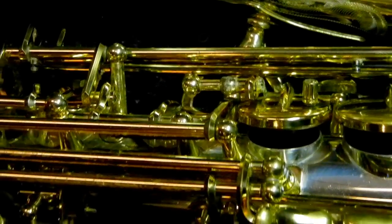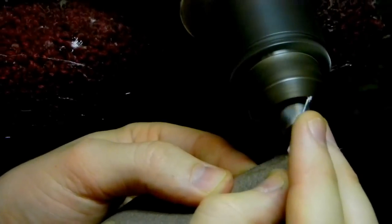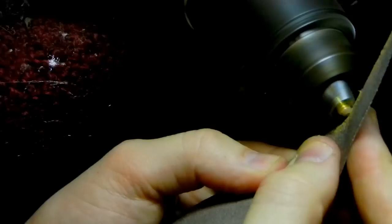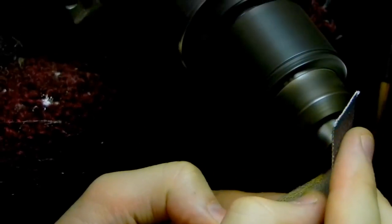Now doming your adjustment material is very easy, and I'm going to show you how. So you've got a bench motor on your bench, or your repairman does. You mount the screw in it, and you use rough sandpaper — this is 220 grit — and turn it down. You'll get a feel for it as you do it, kind of the angles and how to make it work well.